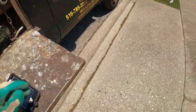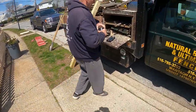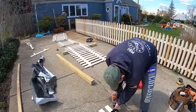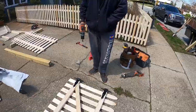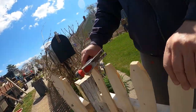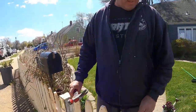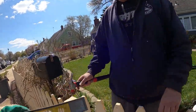That's a half-inch head, so we need to find the half-inch bit. Fits nice — no cracks. Now you can level this. I can move this up and down because the brace isn't secured yet, so now I can bring this picket to this picket with the level on it.